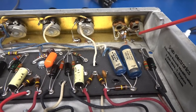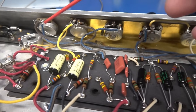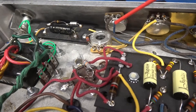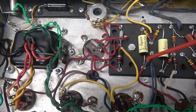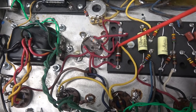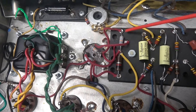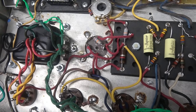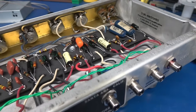Here's the control lineup. I reused the original input jacks and still have the brass ground plate. All these controls are original, and I added the new 100K reverb level pot. Here is the adjustment for the negative bias. I also performed a simple power supply update — in this configuration you can get hum in your reverb because the screens and the reverb share the same feed. That's been corrected: now we have a 1K resistor feeding the screens, a 10K resistor feeding the reverb driver, and then it goes through the 18K resistor for the preamp.